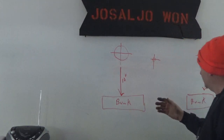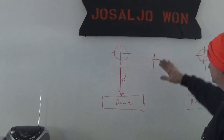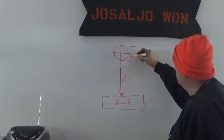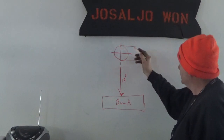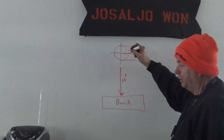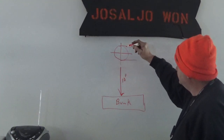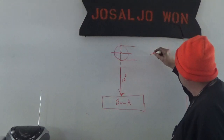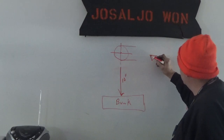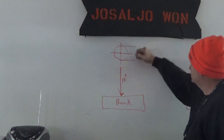So I hope that explained it well enough. All it is: take a tape measure, measure the distance across, put a mark halfway. If it's 12 inches, mark 6 inches. Measure it again on another angle — whatever that dimension is, divide it in two and put a mark there. If you end up with a couple of marks, you can join them — a perpendicular bisector will automatically tell you where the center is. That's the way you find that.